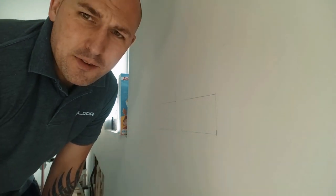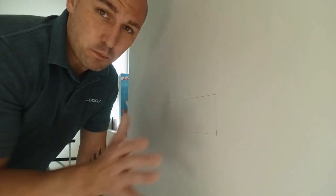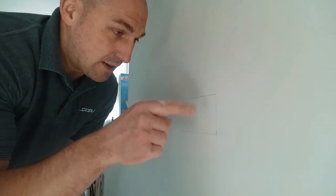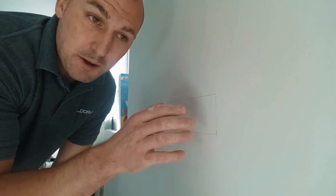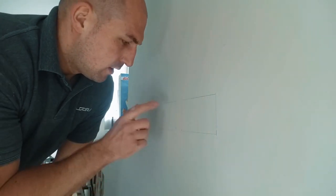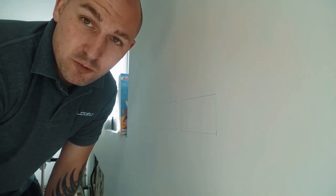They sound alright. I don't think I have any dot behind them. Dot is basically, this is a dot and dab wall. This is a plasterboard sheet. They whack bits of plaster on the back and they stick on the brickwork. Every now and again you get to a section where they'll actually have a bit of plaster that you hit. It can be a bit of a pain in the ass to get around, but it sounds like it's going to be alright. So what I'll do is I'll do a fast forward of this and you can watch me cut it out.